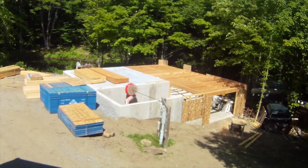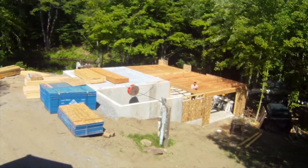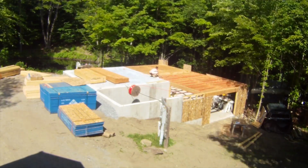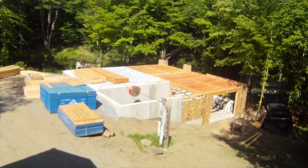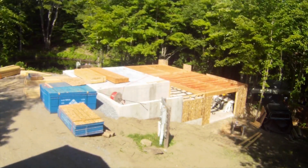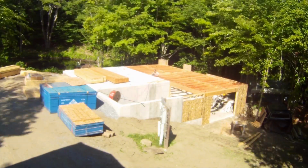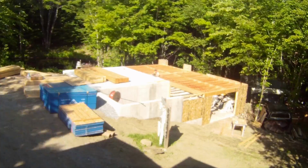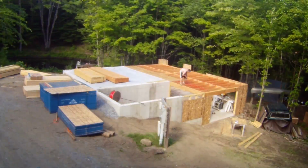Okay, so I routed the tops of the joist so that I could put the PEX in it. And then I modified my previous PEX spool so I could use it for another 1,000 feet. Drill the hole through the middle, put this metal pipe here, let it rest on these, and I was able to pull all the PEX that I needed right from there.